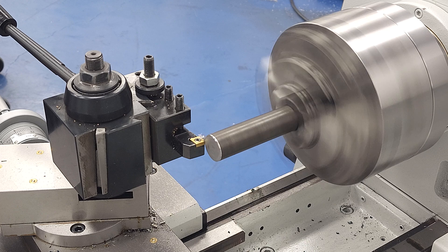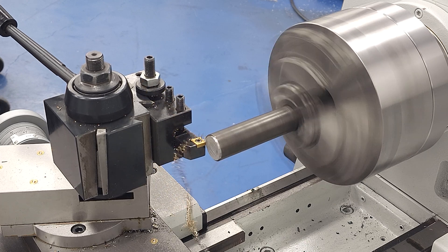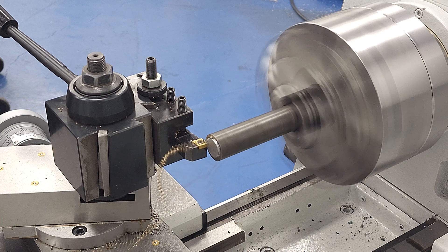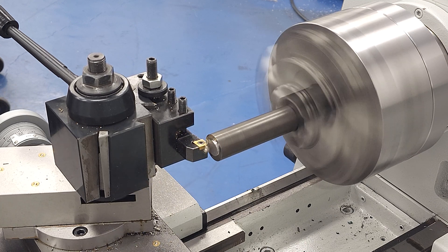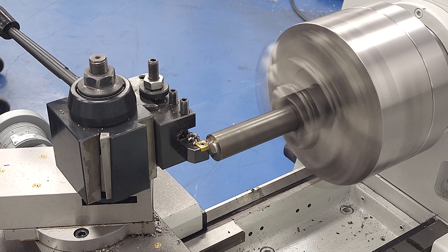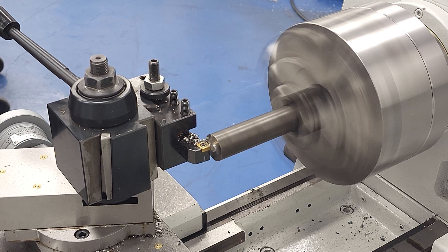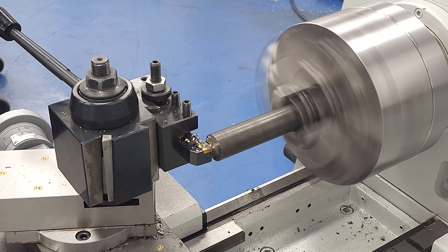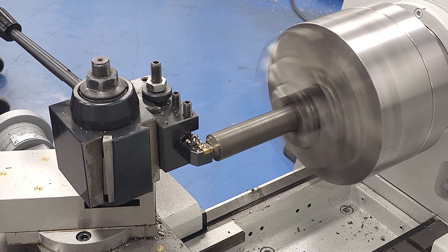Just like always with the lathe, we start by facing off the saw cut from the end of our stock. We made the test bar last video out of aluminum, so we thought we might play around with some steel today. We've got some 4140 heat treat and we're just going to experiment a bit. One of my co-workers saw me cutting it on the bandsaw and asked what I was making — I told him we're making noise and we're making chips.